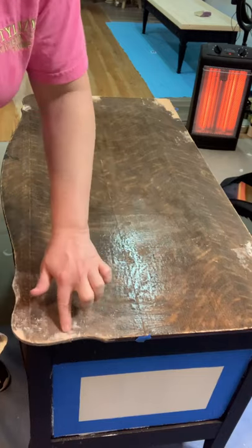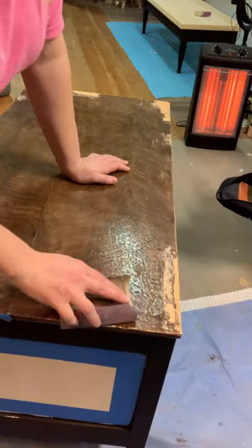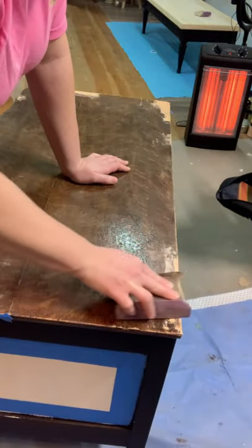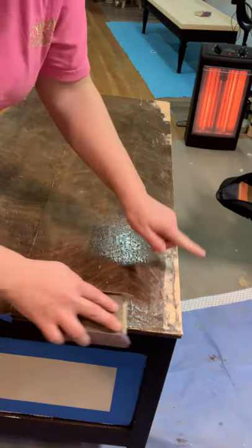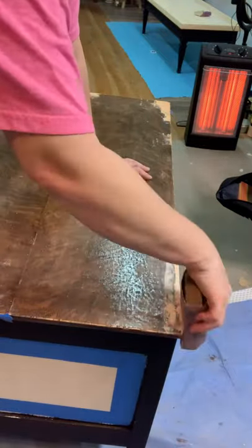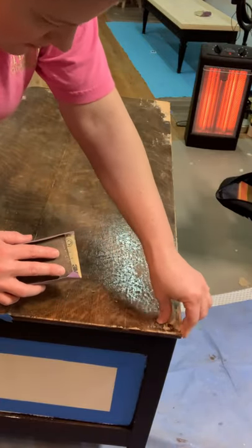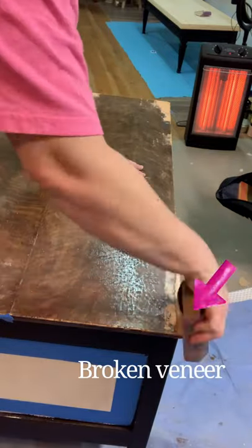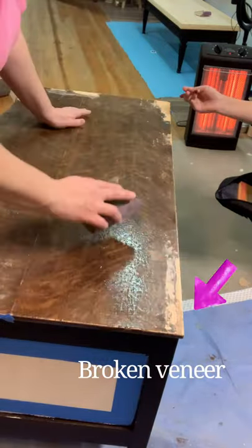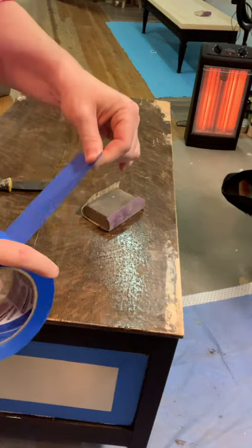You can also post any questions in the comment section. After sanding, I take my finger and rub it across the area where the wood putty is — I'm checking to see not only if it's getting smooth, but also if the area where I applied the putty is raised. Here you'll see I started peeling off some more veneer I missed on my initial pass of repairs, so I had to come back, break it off because it was loose, and then refill it again.